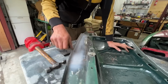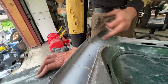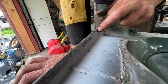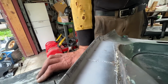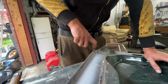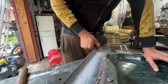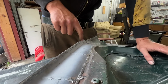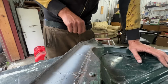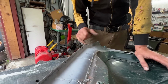So now I'm gonna need you to weld this, this, this, and here. You see now, that's the way I made this piece. I want you to weld here from the corner, fill all this up, and here and here. Okay. It's not how it was meant to be, but that's the old skin. You see, it was short. Yeah. I don't know why they made it so short here, and I didn't make this piece properly to go all the way up. So now I want you to fill it at least here, so it doesn't flop around, because eventually this is very thin, so it's gonna start burning. You have to be very careful, because we don't want to go with the weld all the way to here.